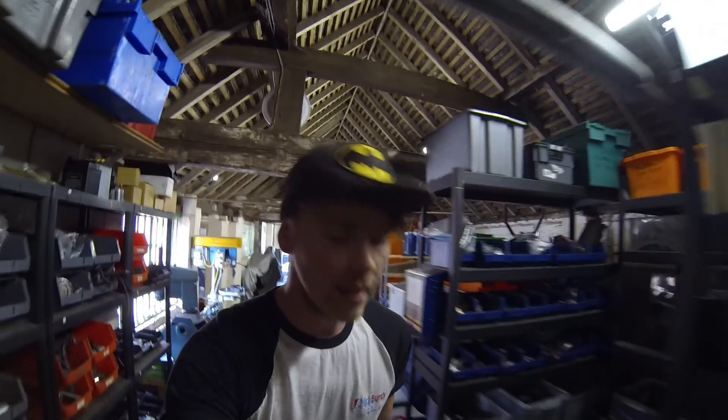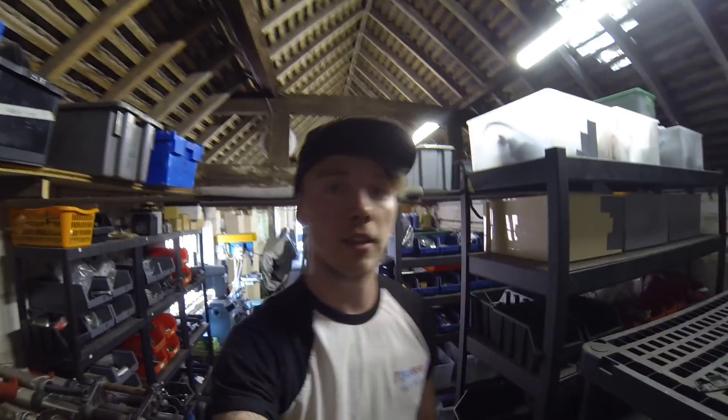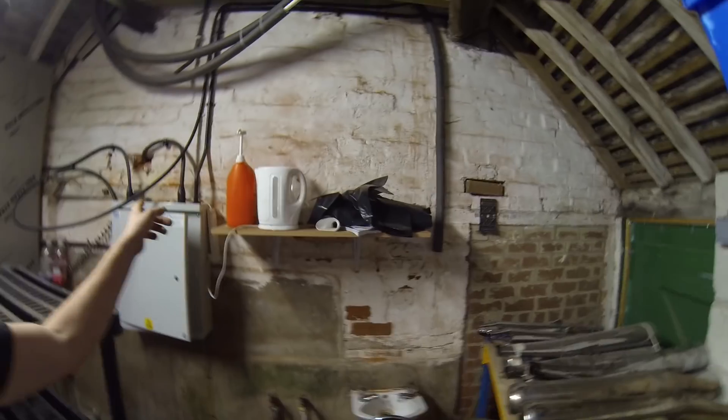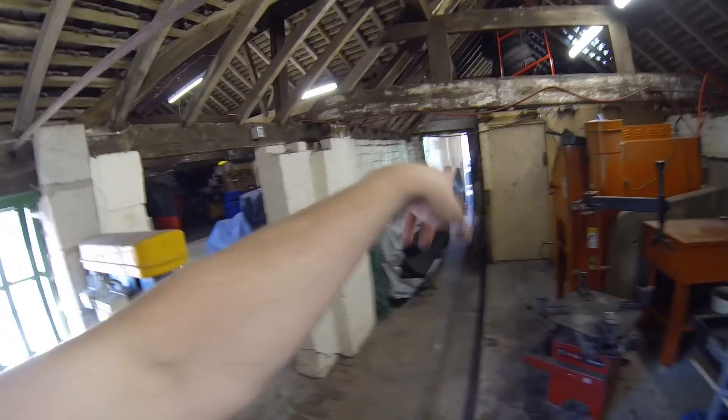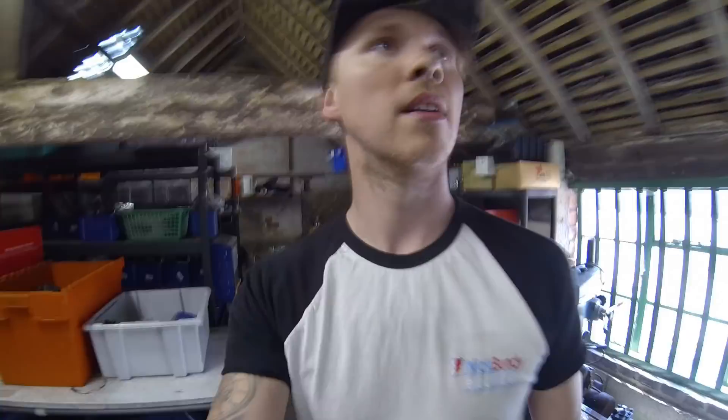The 10mm feed is now at the board - I'll gland that off tomorrow when I'm back. It's all clipped all the way to the top, all rambanded all the way across, back down the far side. I'm going to lock up here and then head over and get started on the lights.